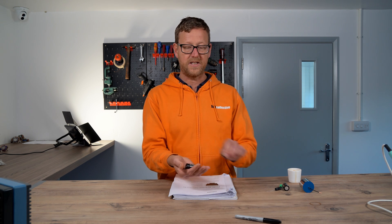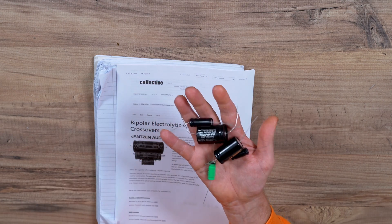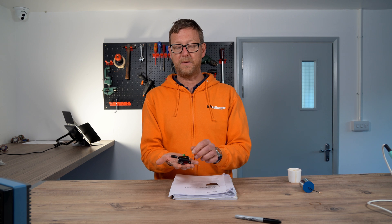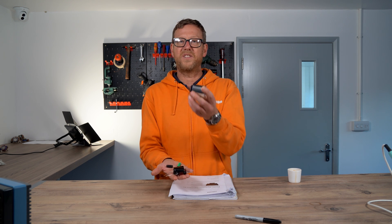You can see that the sizes of these do vary — here's a handful. They're used commonly in manufactured speakers because they're kind of low-cost and low-profile; they're not particularly big. So comparing, these are all 22UFs, and this is a 22UF film cap — actually it's 25, so it's kind of near, which is interesting because I just picked it out of the 22UF drawer.